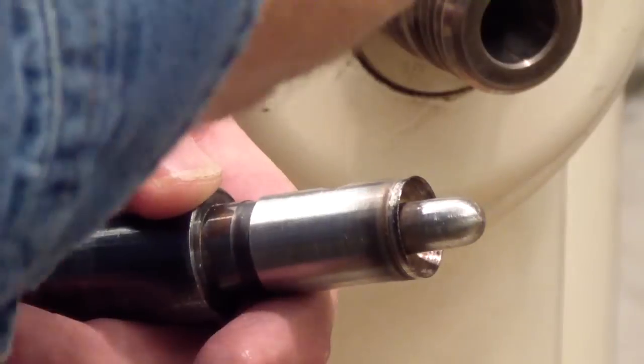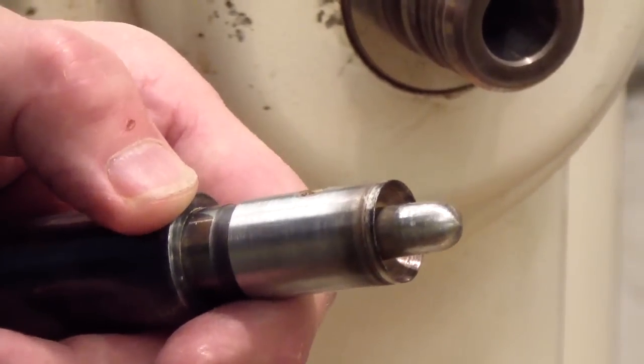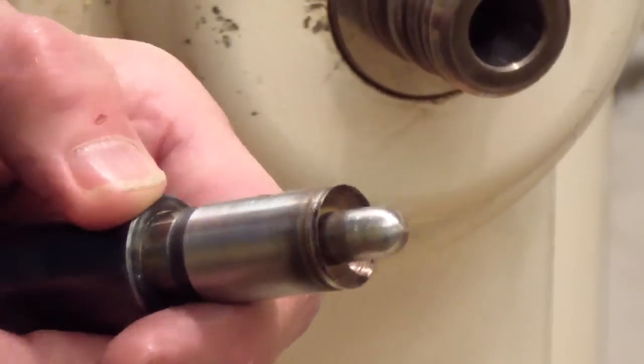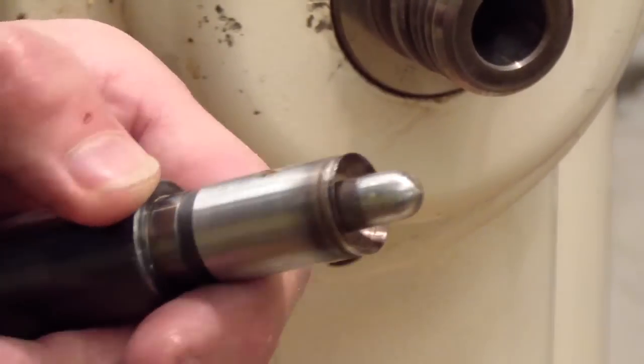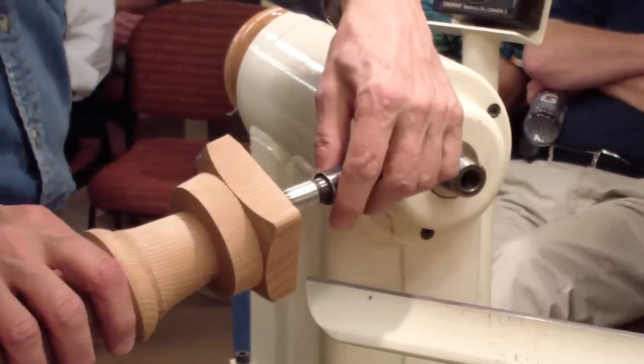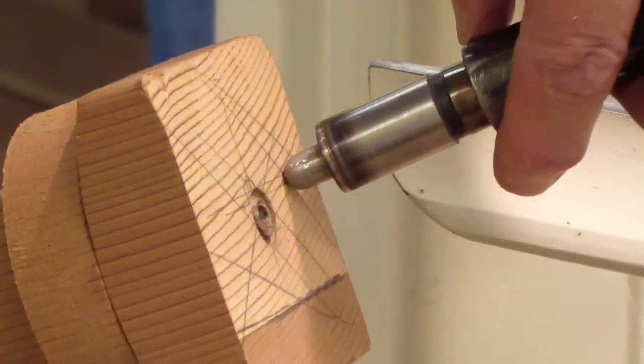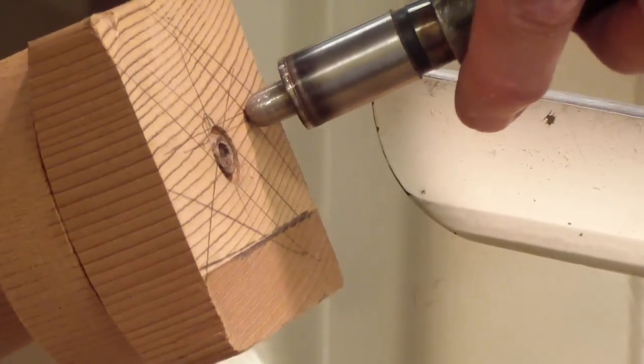So I'm going to make a lamp rather than try to drill a hole so that it's centered the way I just turned. I drilled a hole in the blank first and then set the hole on my center. Now, even if the hole is so far off, I'm clear over here, I'm still going to turn center because it turns on my center. And it works really well.